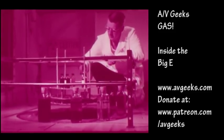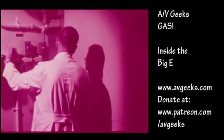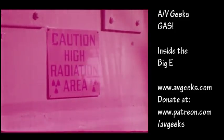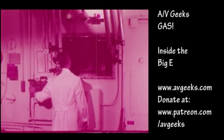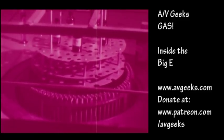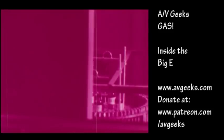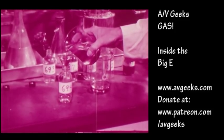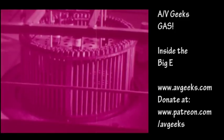Inside the radiation room, various samples are spread around a raised ring to be exposed to doses of radiation. A door 5 feet thick seals off the radiation room. When all is secure, a button is pressed, and hollow steel pencils filled with cobalt-60 appear to expose the oil to powerful doses of gamma rays. A door is closed to safeguard the 42 inches of special protective glass. The tests continue for months to screen out unsuitable lubricants. Once the screening tests are passed, the most versatile lubricants with the best records of performance in industry are chosen.